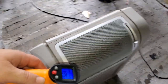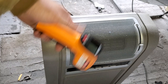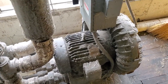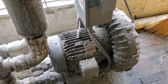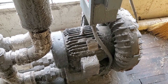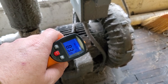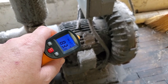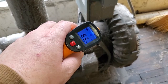If you have a little electric heater and think it might be too hot or not hot enough, check the manual for spec temperatures and verify with this. Motors in a business setting — if you're not sure whether a motor is going bad, check its temperature. Air compressors especially can cost you a lot of money if they're running way too hot. You can check the safe operating temperature range from the factory specs and verify with this instead of just guessing by putting your hand on it — get a good estimate and go from there.